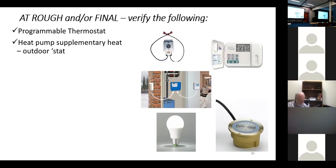Now, there are some advantages in schools and in centers like that that have both a heating load and a cooling load, because they bring that water up from the ground, and they run a loop all the way through the building. And then they hook the heat pumps to that water loop. And there are times that part of the building is cooling, so they add heat to the water, but that water is making its loop around.